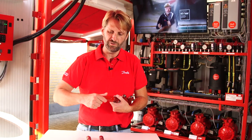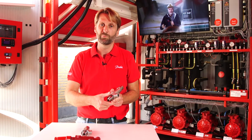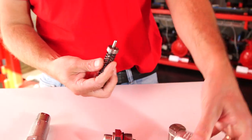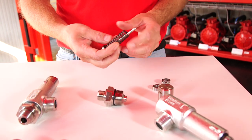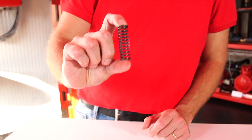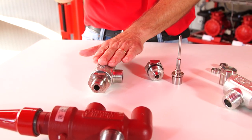Let's look into the product and see what it means in terms of industrial, reliable, and durable design. There are a number of critical components inside which define the function of the valve. First of all, you have the spring. The spring applies pressure to the seat through the cone, ensuring you have exactly the right opening pressure.